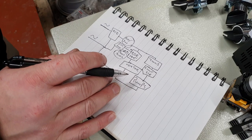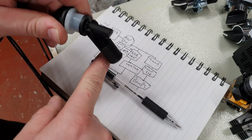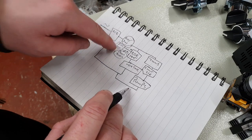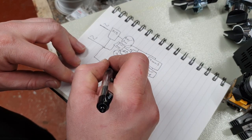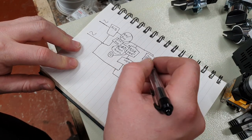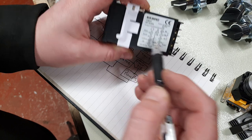Here we have a couple of magnetic float switches — you screw these into the side of the tank, tighten them up, and when the liquid level rises it connects the circuit. Because it's low voltage you won't get any sticking contacts. So that's the solid state relay being controlled by an STC-1000 and a float switch. When it's ready for temperature, obviously we're going to have a thermocouple in the tank as well — that turns the heater on. The other ancillary circuitry for the timers: they've got 240V in there.